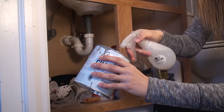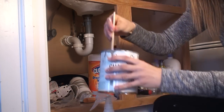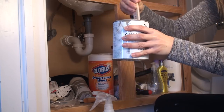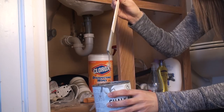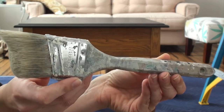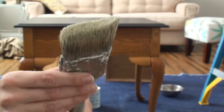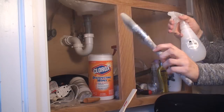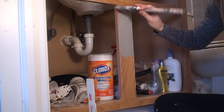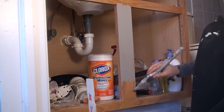I'm going to be painting with Annie Sloan chalk paint in French linen. I'm painting right out of the can today since it's an old can and I'll use the whole thing. If it's a brand new can, pour it into a separate container and work from there. A great tip: tip your can upside down 20 minutes before you start to distribute the color, then give it a stir. I'm using an all-natural bristle brush — my go-to. I'm going to spritz it with a little water since I'm going for a smooth finish; keeping your brush wet every minute or two helps alleviate brush strokes.